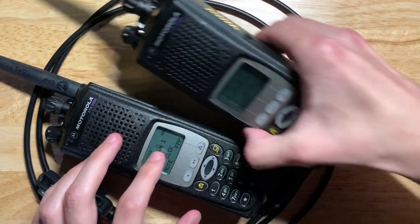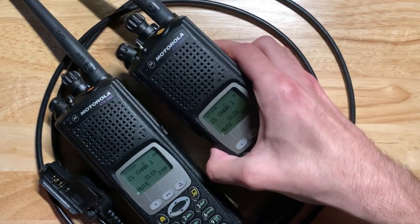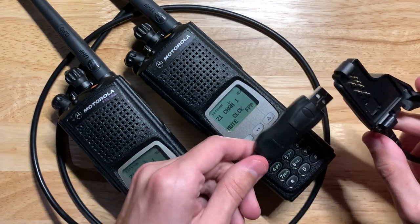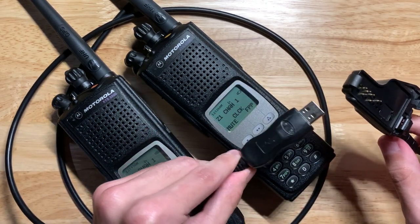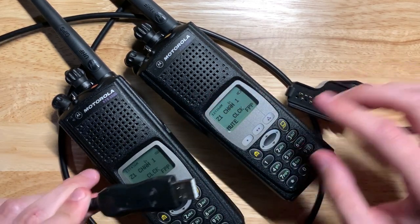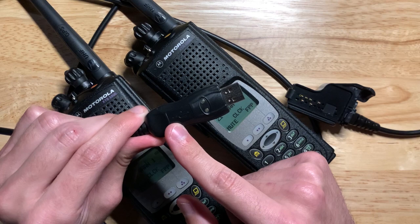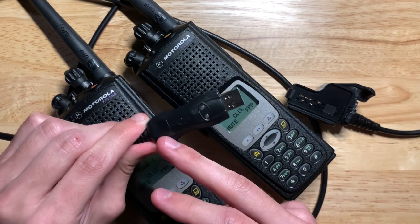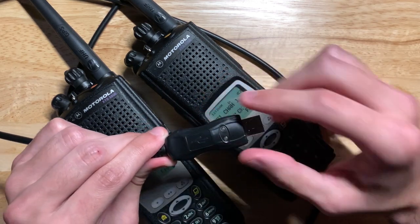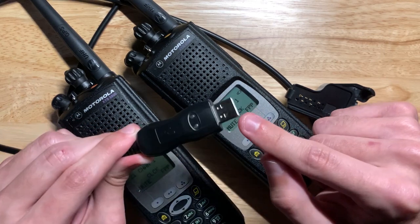So we have two XTS 5000s right here. These are basically identical, and we want to program them, right? So we need a programming cable right here, and this is a USB one. I'm going to have a link down in the description below to this. Now, one thing that's special about these radios is that they actually do not have USB. The chip inside here is a USB to serial interface adapter, and specifically it's serial RS-232. So it's one of the older serial standards, but you need to have this FTDI chip, this USB to serial adapter, in order for you to use USB.